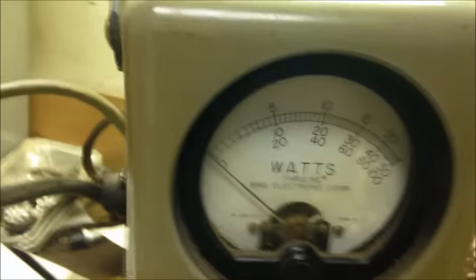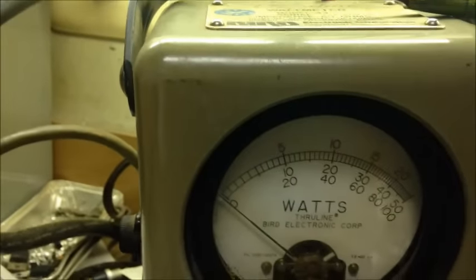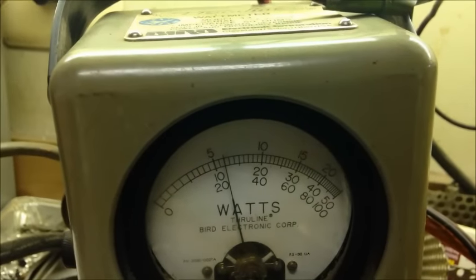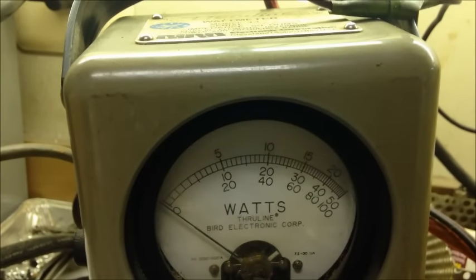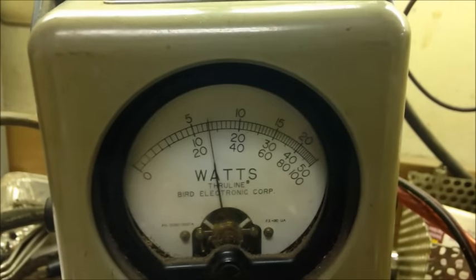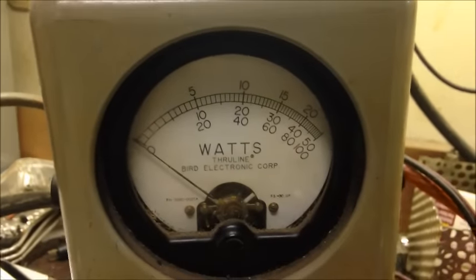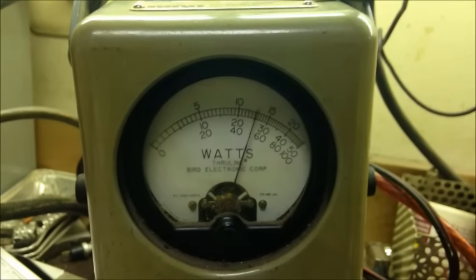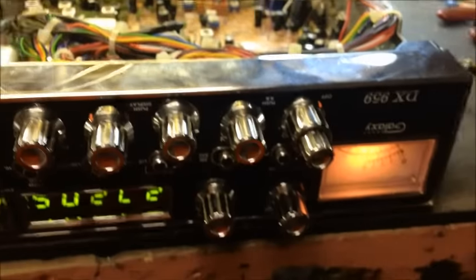Go over here, 50 watt slug. We'll switch up hands here for a minute. About 3 watt dead key. Oh, yeah, a 12 bird, which is respectable. Let's see, dead key, and that's the nature of these radios. There's 5 watt. Oh, yeah, about 14. Don't usually like to run it there, but 3 or so is good. 2, whatever it takes for the amplifier. Peak side. Yeah, 26. So there you go. We'll be back with the amp in line.